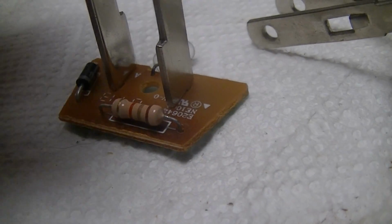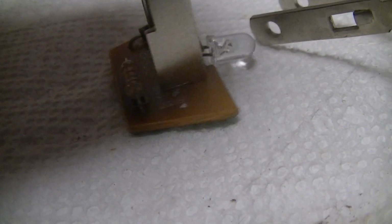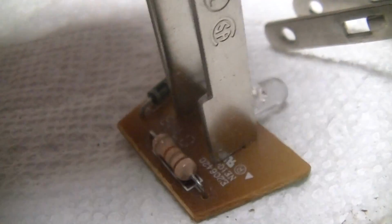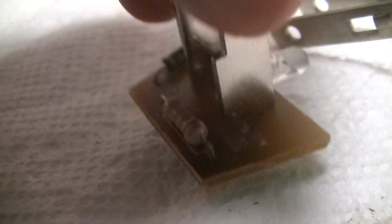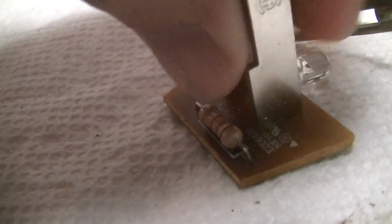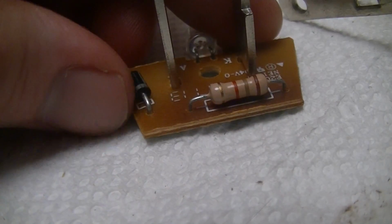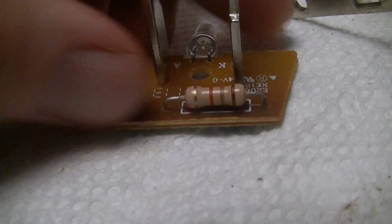There's just the guts of a cheap, nasty LED nightlight that failed recently. Quite simple circuit, just a pair of PCB mount receptacle blades, or no, plug blades. There, half watt, 18,000 ohm carbon film resistor. Bog standard 5% stuff. Guess it has gotten a little bit toasty over the years.